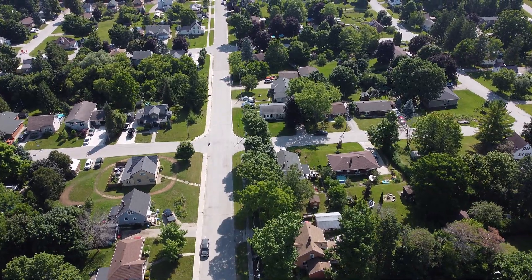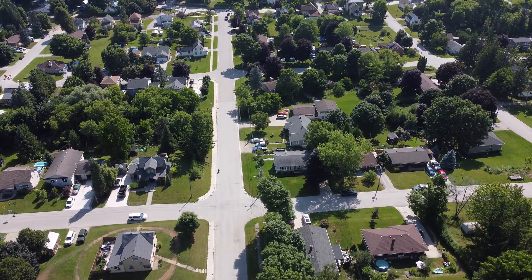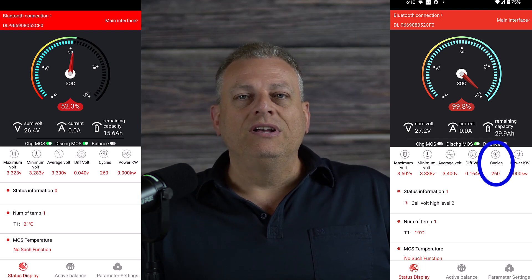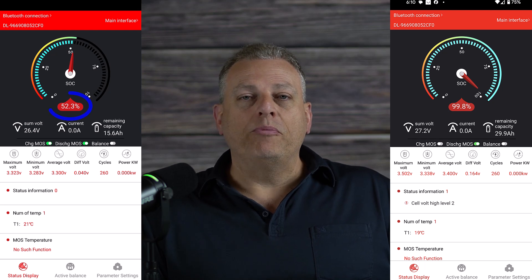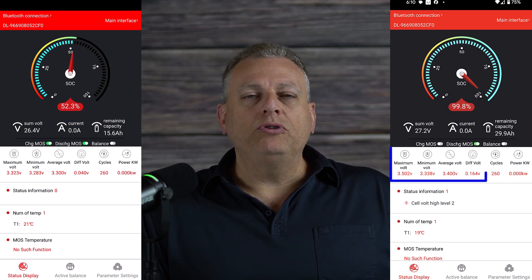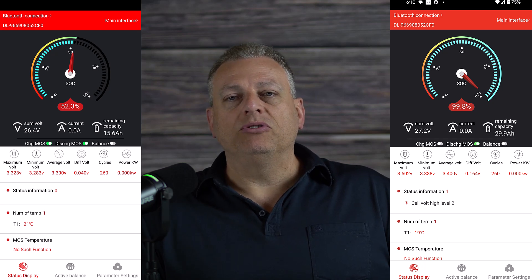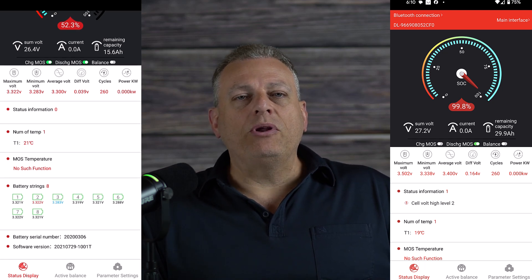All of the footage up to this point is from more than two years ago — it is hard to believe it has taken me this long to get this video out. I am happy to report that this battery is still working just as well today as the day I made it. I have not touched it since it was originally installed. If I log on to the Bluetooth BMS, we can see that there has only been 260 charge cycles so far. At this charging frequency, this battery could last 30 years. The screen captures show the battery at two different states of charge — 52% and 100%. I'm not sure why the BMS amp hour capacity is so far off, but the voltages seem a bit out of whack at the upper end with a fairly significant voltage discrepancy. At some point I will probably add an active balancer or replace the BMS with one that has a built-in active balance feature to keep them continuously top balanced during charging.